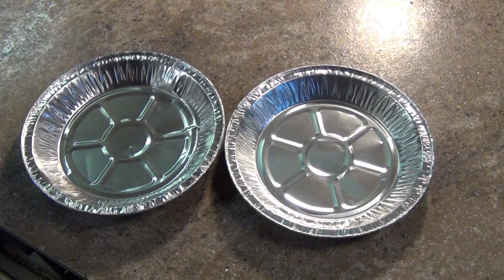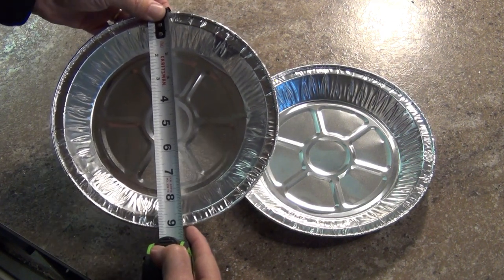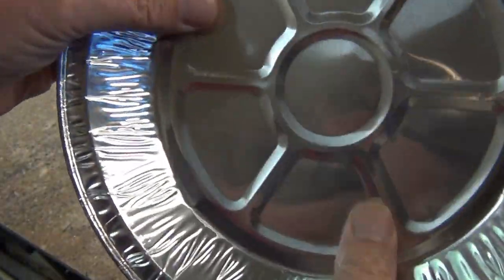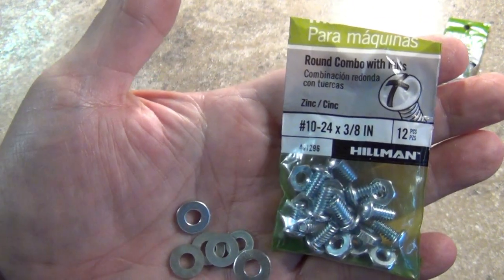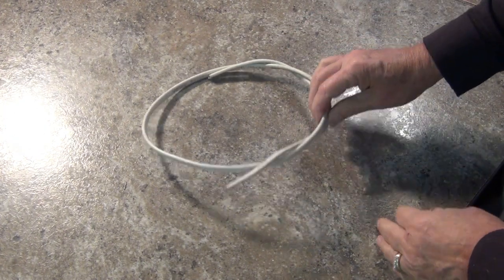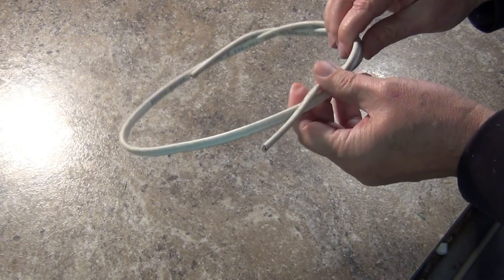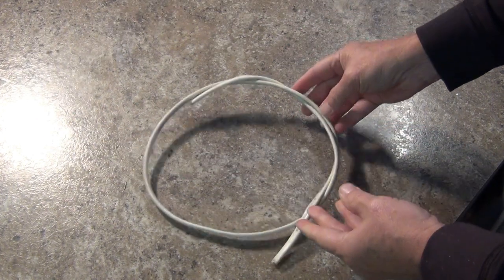Enough talking, let's get to building. You will only need a few basic parts to make this antenna. The first thing you will need is two nine-inch aluminum pie pans. You probably have a few laying around, but if not you can buy them cheaply. I got these from Dollar Tree but I don't really care for them — the aluminum they used is really thin so it makes it difficult to fabricate. Next you will need six small machine screws, six washers, and six nuts. I'm using number 10 by three-eighths inch screws. Now you'll need some wire to connect the pie pans together. I tried to skip the wires and just attach the pans together directly but I couldn't get any increase in performance that way — in fact the performance slightly suffered. You will need some solid wire; I'm using 14-gauge Romex house wire as it's nice and stiff but easy to work with. Use the bare copper wire — a 10-inch piece is needed.